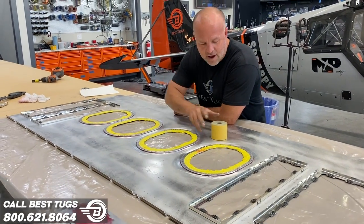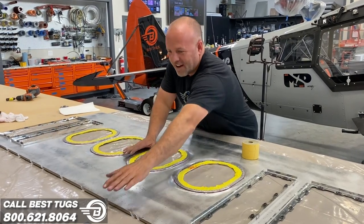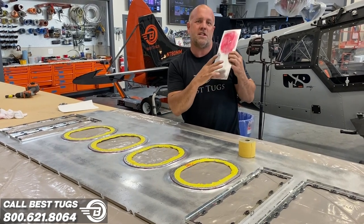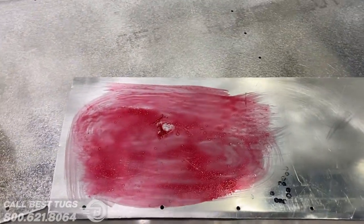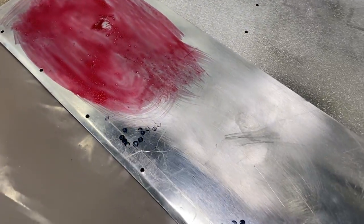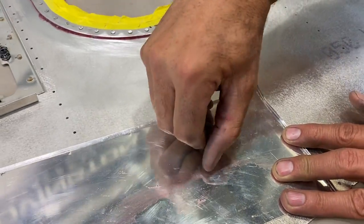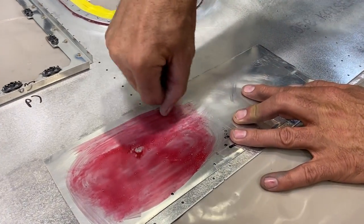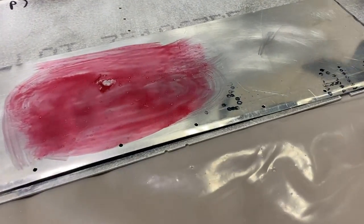Okay, I've just finished sanding this off. If you guys are wondering what grit, I use 120. I did some testing on this right here, just with different tank sealers. And the difference between no sanding versus a Scotch-Brite finish versus a 120 grit finish, if you're wondering, if you don't prep it, even if you cleaned it, you can get your fingernail and scratch it off. And I know that the pressure tries to hold it on, but I'm actually peeling off the bonding tank sealer. If you use Scotch-Brite, I had to work at it with my thumbnail like crazy. I would say it would never come off. However, I could eventually get it off with a Scotch-Brite finish.